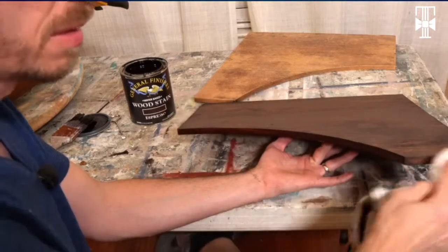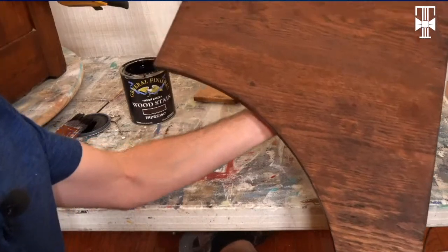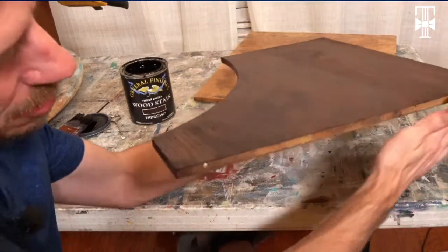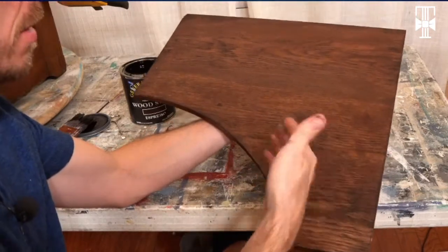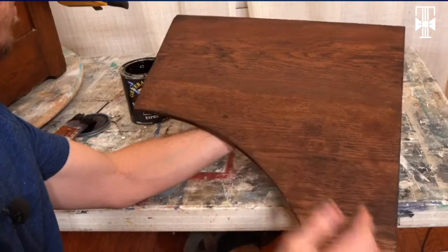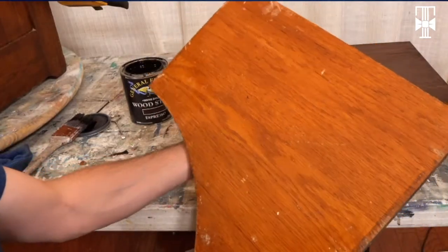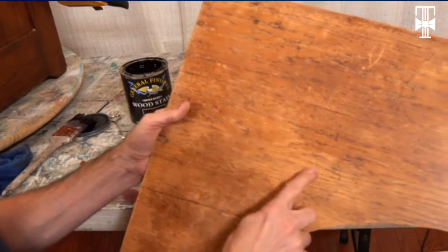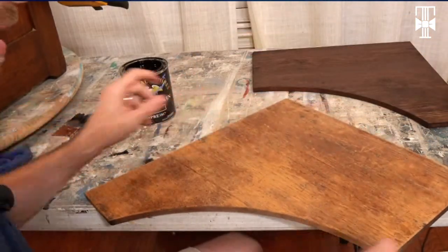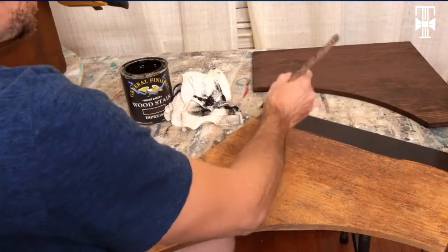Wipe the sides a little bit. Tomorrow I'll inspect it one last time, but this is where you ask yourself: one more coat, or is it ready for topcoat? I like the look of it — I like seeing the wood. There are parts with staining from previous years and I want all that to be there. The tops were lacquered, but I sanded that off. You can see all the circle rings from bottles and jars. I'm okay with not trying to wipe out the age of the piece, but if you're trying to hide all that, you'll probably need two coats.